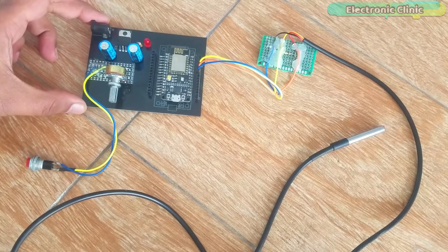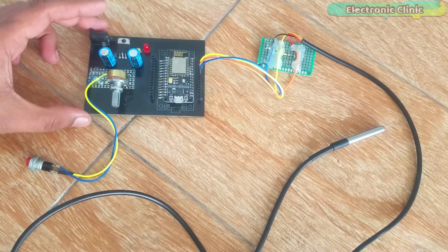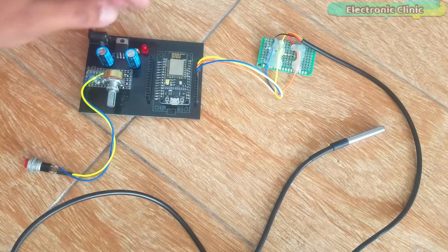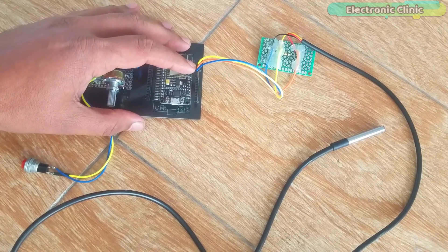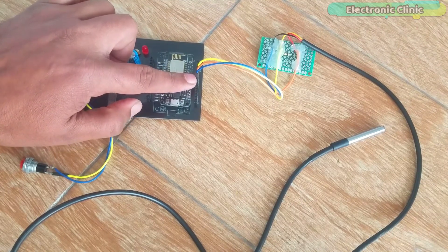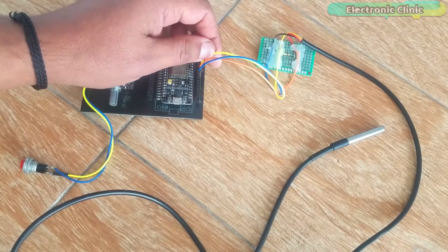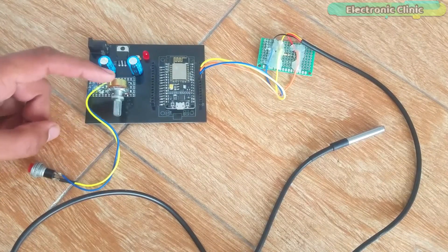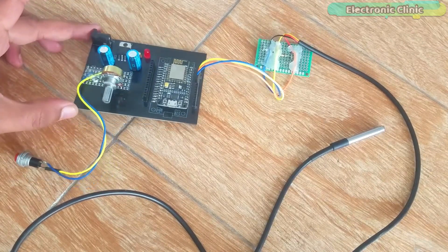This is the final circuit board manufactured by PCBWay. The quality is really great. The PCB board file and schematic can be downloaded from our website. The orange wire, which is the VCC wire, is connected with 3.3 volts. The ground wire of the DS18B20 temperature sensor is connected with the NodeMCU module ground pin. The yellow data wire is connected with digital pin D4 of the NodeMCU module. The push button is connected with pin D0, while the variable resistor is connected with analog pin A0. All connections are exactly the same as explained in the circuit diagram.